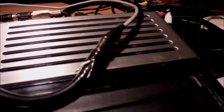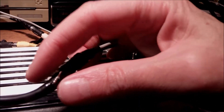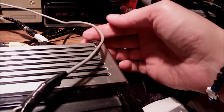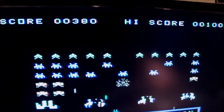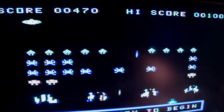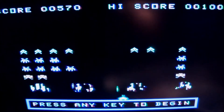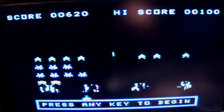I did it quick and dirty here — you can put sockets or whatever you wish to connect the DIN jack from the computer to the TV. I did it with some tape. I left out the audio for later so I can add another RCA right there. For now I only have the video cable — the composite — just to conduct the initial test and feed my TV with the signal. And you can see it's pretty clear, stable, and a pleasure to the eye.